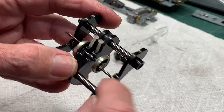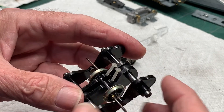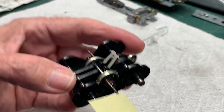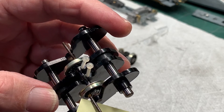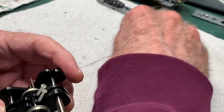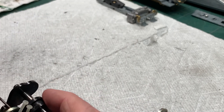You tighten up the little screws to keep the axle securely in the slot, then rotate the axle until the crank pin hits the template on one side. Then you take the template on the other side, push it on, and see how the fit is on the other crank pin - does it hit the template exactly or is there a small space? I tried to slip a piece of paper in between the crank pin and the template and when everything was tightened up it wouldn't quite go in there - so it's within the thickness of a piece of paper of being the right quartering. This is the non-driven axle. The message is: if I re-quarter the driven axle using this same tool, the quartering should come out close enough to match.